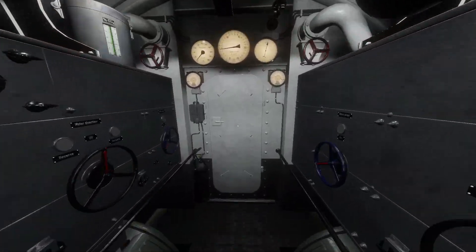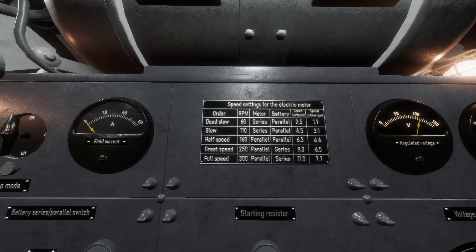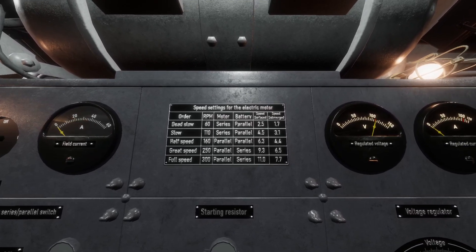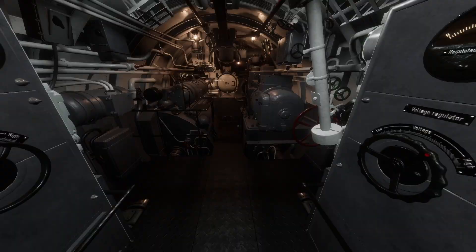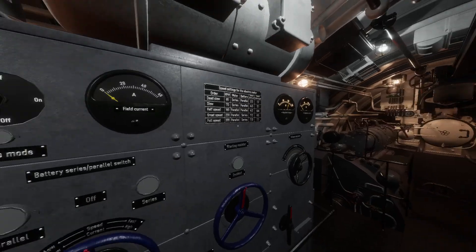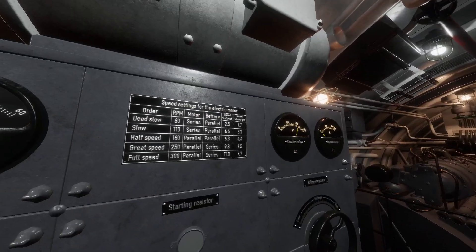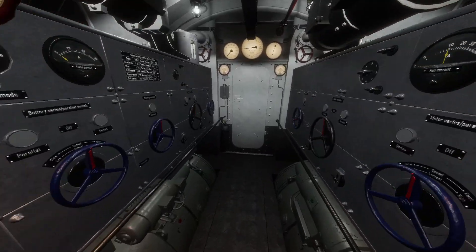So the first thing we're going to do here — you see we're on the surface. This is our engine card here. You've got your RPM, your motor, battery, surface speed and the speed submerged as well. Bear in mind the speed surfaced and submerged is when both engines are running in parallel together. So when both motors and both propellers are turning the exact same speed — at the minute nearly 500 RPM, 480 — when it's running at dead slow you'd get 2.5 on both. It wouldn't be 5 surface speed with just both of them combined, so keep that in mind.